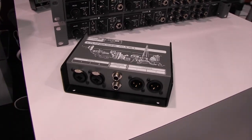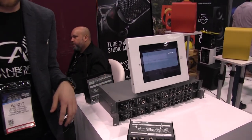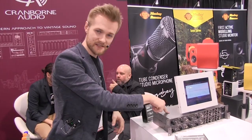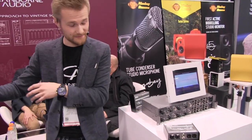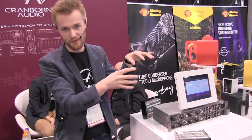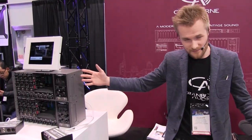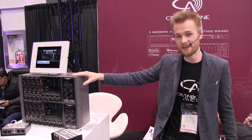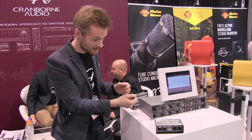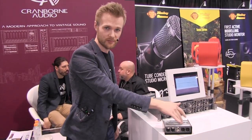One final trick is that the EC2 can also connect straight up to our 500R8. You can connect an N22 into this box and then this into the R8. What that means is inputs that you put in here travel into the preamps, and from the preamps they travel through the CAT5 directly into the R8 for recording. At the same time, the monitor mix that you generate here travels through the cable, goes back into EC2, you mix it in, and it arrives directly at the outputs of this box. It sounds quite complicated, but it's all plug and play, all analogue, and really easy to set up. And that's about it — thanks for coming by, thanks for checking it out, see you soon.